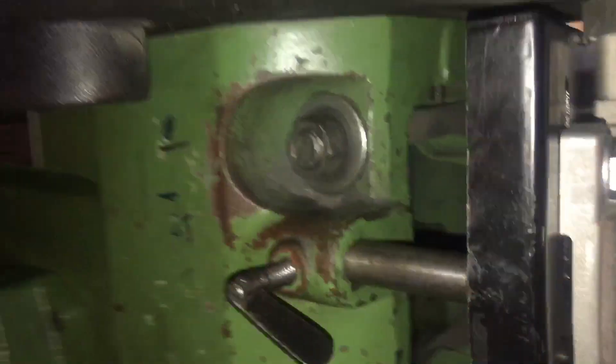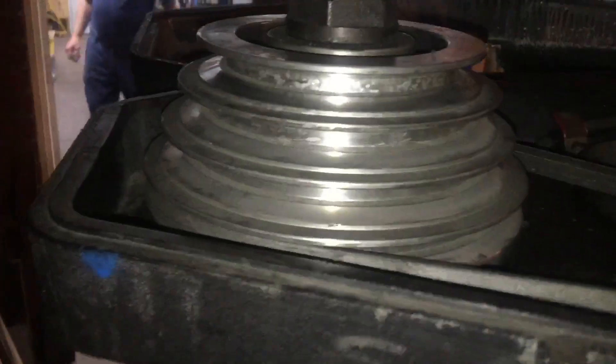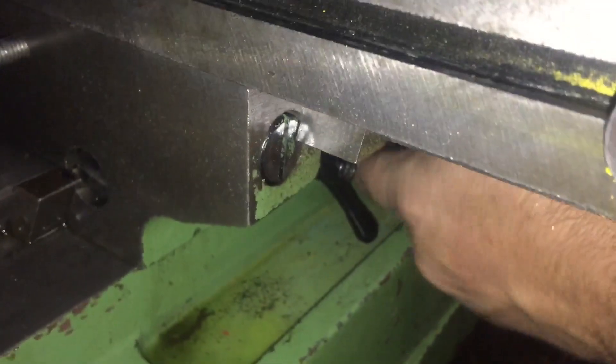Progress: we have the motor mounted up, complete with assemblage. We're just running the cables to the reversible switch now. The table is all still clean as it was in the last shot. We're very close to being able to spin this one up again. We're going to spin it up at low speed first — pulley smallest to big, smallest to big — should be the slowest speed. Got my locking handles in there now, locking the X and locking the Y. Happy days.